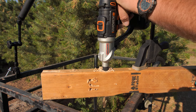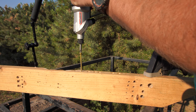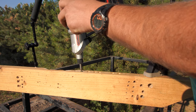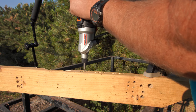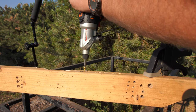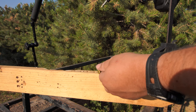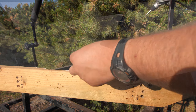With the largest twist drill bit I had, it did a good job. For exterior screws, it worked great up to about 3 inches in length. Once you got to about 3 inches in length, you'll either have to pre-drill your holes, or you'll have to do some granny driving — where you stop and start multiple times to get the screw fully into the surface. Personally, I actually kind of like doing it that way, because it keeps you from putting little divots all over your wood where screws are.